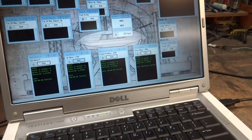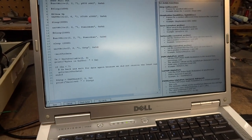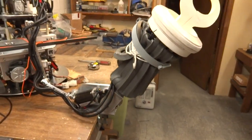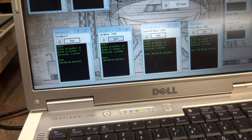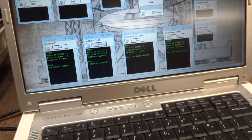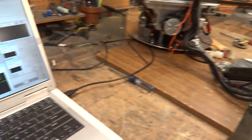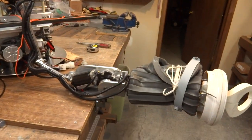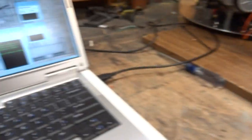So it'll go up. I have a set point of 3100. Let me lift the arm up with this script here — I'll swing around so you can see it come up. Nice and smooth. Beautiful. It's not important where it goes up, but it's reporting 3098 — that's just 2 millivolts from 3100, which is okay. That could be off a little bit, because I'm mainly concerned with it centering up so it'll come into the torso. Let me take it down. I have a set point of 2500 millivolts. Nice and smooth, nice ramping — and you can see I'm right at the top of that opto switch. Perfect. Almost exactly where it was.